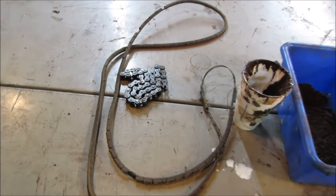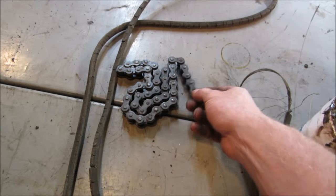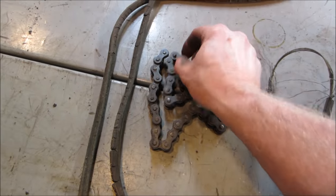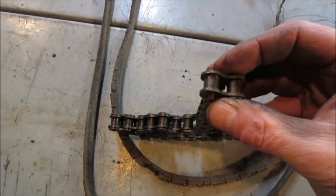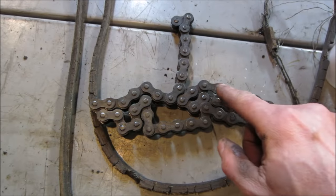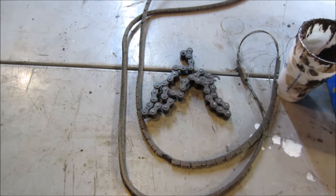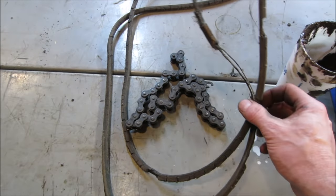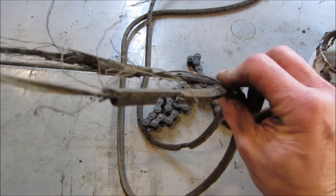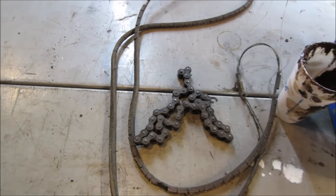So this one pretty much just came down to a busted chain. A pin walked and was floating, started rubbing against other gears with the other end of it, and caused the chain to elongate and break. That's what took it out of life. The mower deck, I don't know when the last time that deck spun around was. I would say it's probably been a good 10 years that it sat like that for that to happen to it. Whether that was mice that chewed the rubber off or just weather that eroded it, I'm not sure.